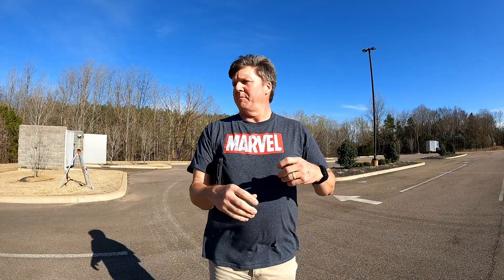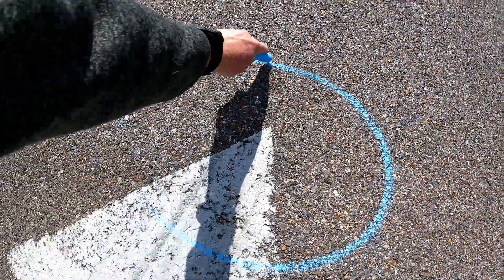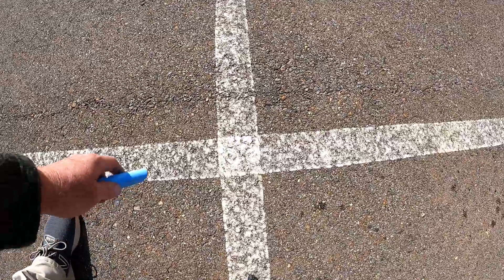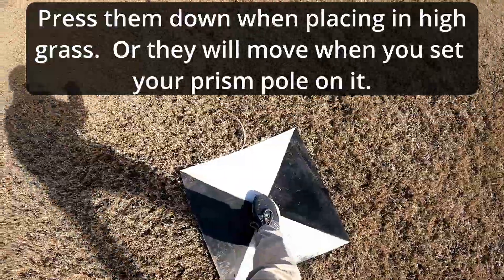Let's start collecting some points. Before we go collect the points, you have to decide where you're going to put them. Keep in mind that ground control points do not have to be targets you throw on the ground. They can be painted arrows on concrete, well-defined concrete corners, asphalt corners — manhole covers are excellent, they're easy to spot from the air and round, so it's easy to find the center point. Painted stripes on asphalt are also good, like the lines at a stop sign. Anything permanent on the ground and well-defined makes an excellent ground control point. When you're out in the field on grass, then you do need to use a target you throw down.